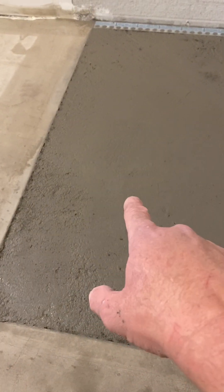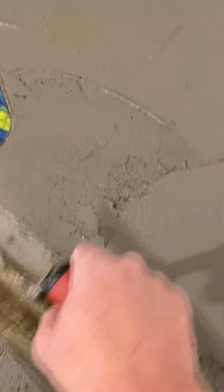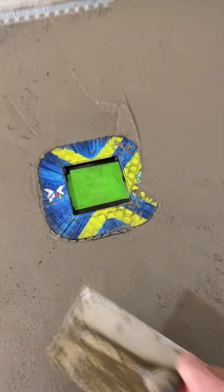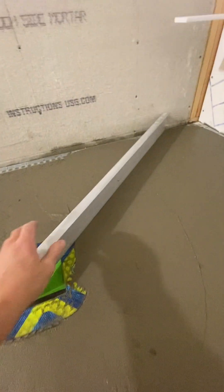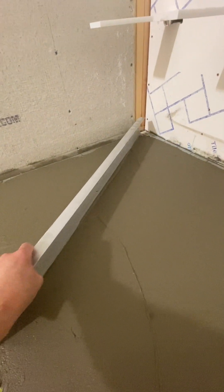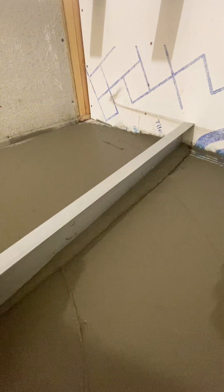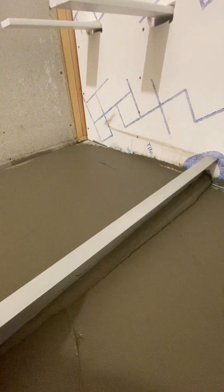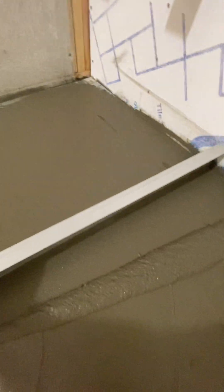It's been about 15 minutes since I finished that. You can see it's still a teeny bit soft, but it's almost getting firm. Mixed up a really runny tiny batch and I'm just carefully troweling it across the surface. Then I'll take my straight edges one last time and just screed all the way around. See how it just rolls up on there — you don't really even need to move it back and forth, you just drag it across. That'll give you a nice smooth finish. Then when that firms up, I'll rub it down and clean it up and I'll be done.